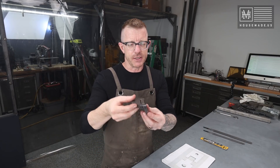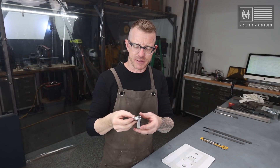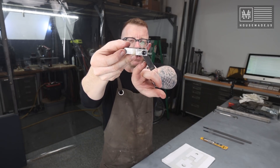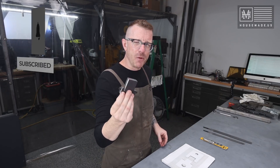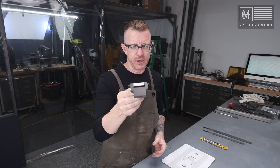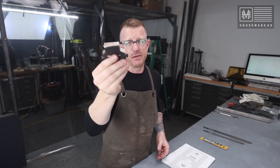I spent the entire day yesterday fabricating this prototype of what I was thinking. A tracking mechanism on a 2x72 belt grinder is not a complicated endeavor at all — it's just a hinged piece of metal that has to lay flat and articulate in two directions. The concept is very easy. I wanted to come up with something somebody could make themselves, and when I designed and cut it out I realized it's still too complicated.